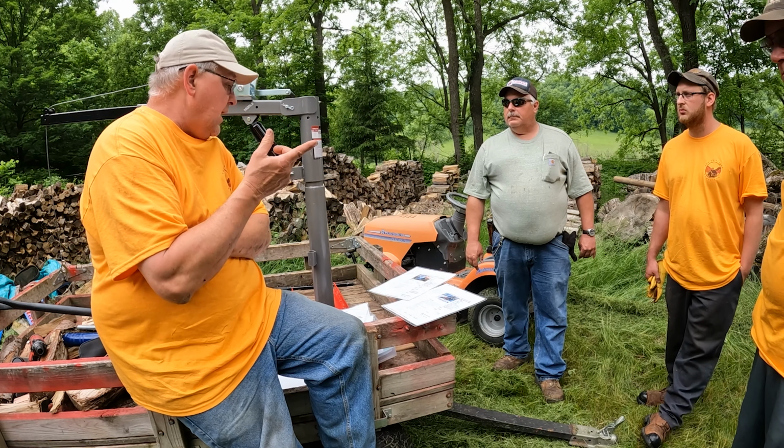It's got this grease fitting here that greases the push plate, and you'd grease that, I guess, every few hours, 4 hours or so. You pour a lot of grease into it up front, and then it absorbs the grease and it'll lubricate itself after that. So it's a little bit tight there. I don't know what kind of grease guns you got at home, but I would get one with an electric, but a stiff, kind of a stiff hose.